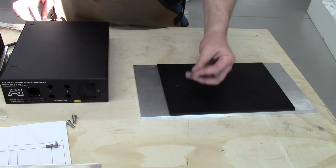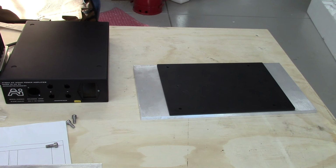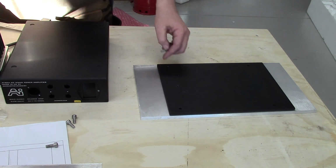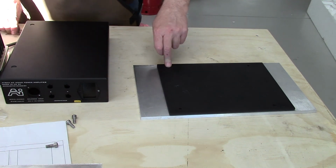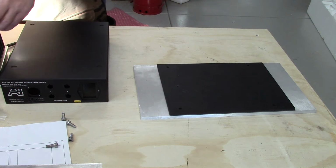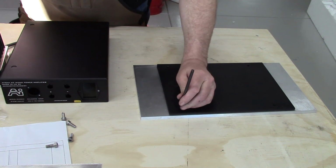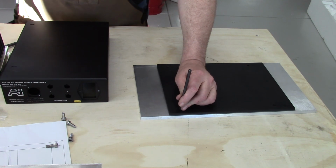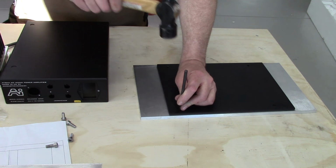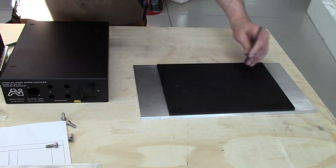These are 6mm, which is just under a 1/4 inch, I believe, or pretty much right at it. 225. So if I just drill some 1/4 inch holes, that's fine. These are 257. They're 6.5mm, which is bigger than is needed. So if we take a 1/4 inch punch, it'll be a little bit loose, but it's plenty close enough for this. So we'll just put 4 little pricks.